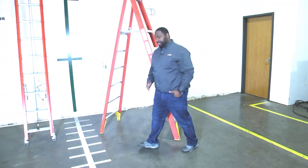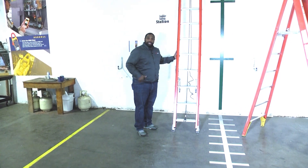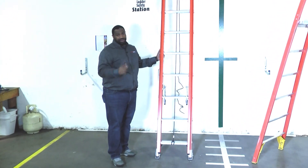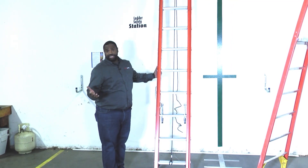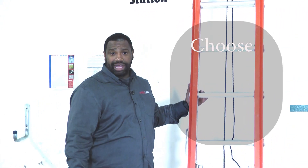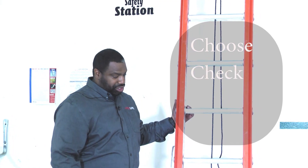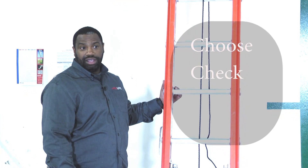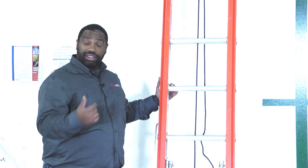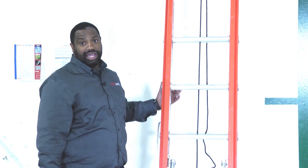There are just a few other things to check when talking about ladders. Ladder safety is very important — sometimes we're dealing with very tall heights and we would hate to have someone fall and hurt themselves. Let's recap the simple rules: Number one, choose the type of ladder appropriate for the job. Number two, check the ladder for any safety issues that might compromise its structure. When climbing, we've got the three-foot rule — three feet above the apex or top of the roof line — the four-to-one rule — for every four feet up, come one foot out — and three points of contact at all times.